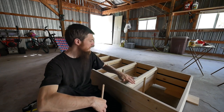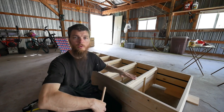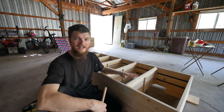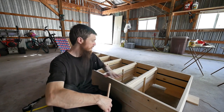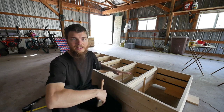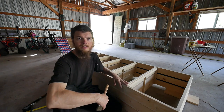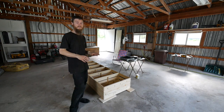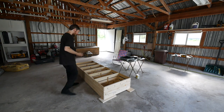Last night after I got the last trim put on, I hole-filled it all with some wood filler and let that dry, sanded it off, blew it off, cleaned it off — the whole thing looks really nice. Today I'm going to be shellacking it just to seal the wood and give it a nice little protective coat. There was a black smear when the brush went over it. The shellac is dry now and I'm going to flip this over and get the back on it.